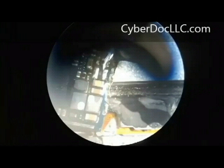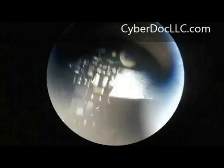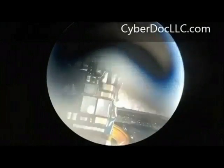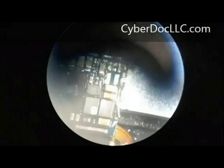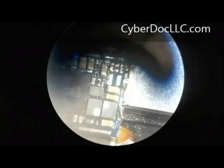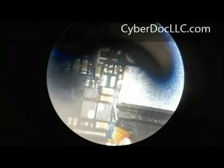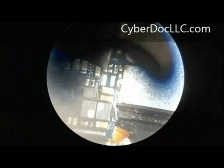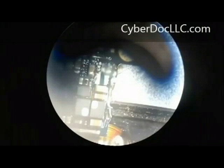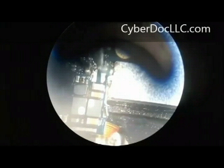So now I have a huge chunk of alloy bridging all over — that's exactly what I wanted. Now I put some alcohol on to clean off the flux residue. It doesn't matter what flux you use — I use high-quality synthetic no-clean flux — it's still going to have some tacky residue left by the flux. It doesn't matter what flux you use, it's going to happen. But this is a lot better than the organic rosin flux. It's considered a little cleaner, but it still leaves residue and we still have to clean it sometimes.